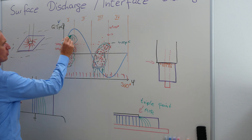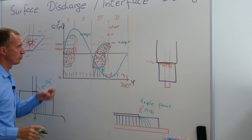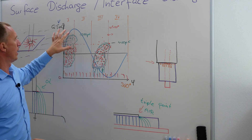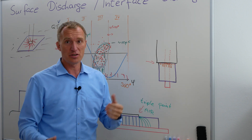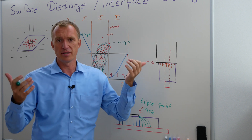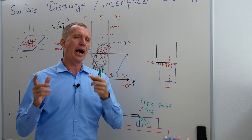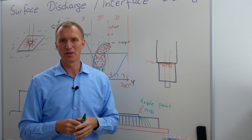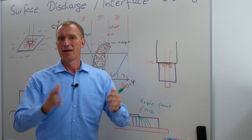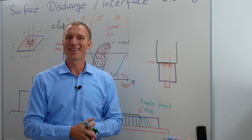So I'm expecting that this one probably is around 1,200 picocoulomb, so 1.2 nanocoulomb. I'm not saying that it always must look like that, but just a rule of thumb. If I look at one of these diagrams, I say, oh, that looks like a surface discharge. I could mistake it for a void discharge, but that's another video. Thank you very much for watching and hope to see you soon. Bye-bye.